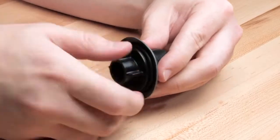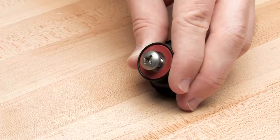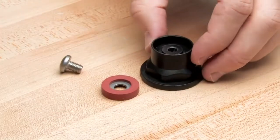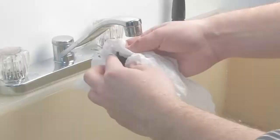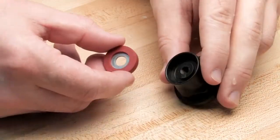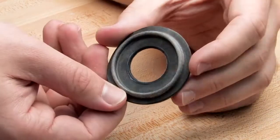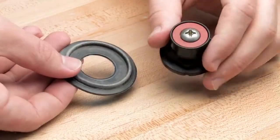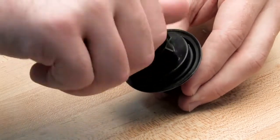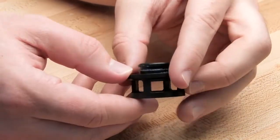In order to inspect the diaphragm, first disconnect the diaphragm assembly by removing the nut. To inspect the rubber, disconnect the relief valve screw. Rinse each component to remove any dirt or debris and dry thoroughly. Begin by inspecting the disc for nicks or cuts and replace if damaged. Reinstall the disc rubber. Closely inspect the diaphragm for any nicks, cuts, or debris and replace it if damaged. Once inspected, rebuild the diaphragm assembly with the molded step of the diaphragm pointed down towards the relief valve stem, and firmly tighten the nut. Inspect the relief valve seat and seat O-ring for damage or debris — clean or replace as needed.